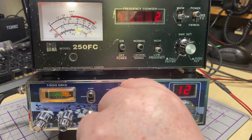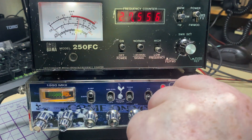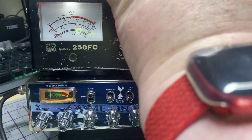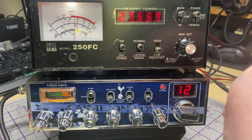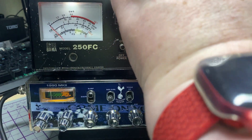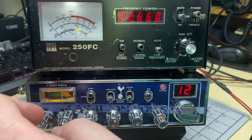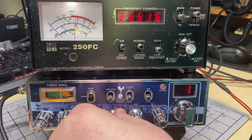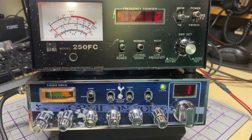Not entirely to my taste, but anyway. We've got the radio on and we're just going to make sure it's behaving itself before we do anything to it. We've got a nice four watts output, swinging the meter over on SSB, and we've got four bands: low, mid, high, and UK FM. Everything seems quite normal — no trouble at all. So let's get to the modifications.